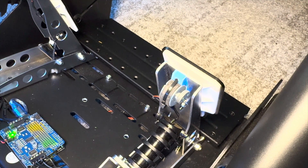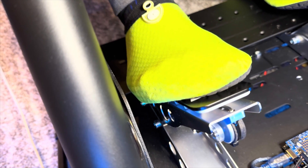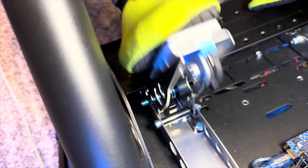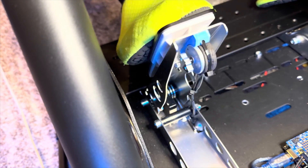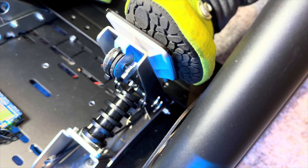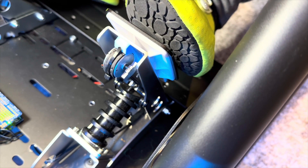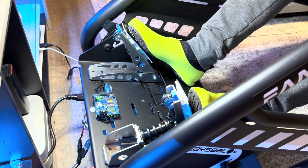I did put that design up on Thingiverse, so if anybody wants it I'll throw the link in the description. Here's the final product in test mode in SimHub, and here it is in practice. I think this is a really valuable mod, especially if you're already doing wind sim and have an Arduino Uno and a motor shield — it's pretty simple and very inexpensive. The feedback you get from wheel spin on your accelerator and wheel lock or ABS on the brake is more valuable than I thought, and with that direct input on the pedal it's more valuable than having it on a bass shaker. Hope you dig it — go try it yourself. Any questions, drop them below. Thanks for watching.